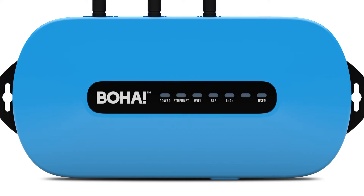It's important to know that the BoHa Gateway's signal is strongest when it's in an open space and not located inside an enclosure, such as a cabinet. The BoHa Gateway will flash three LEDs when successfully connected: a solid green for power, flashing green for Wi-Fi or flashing yellow for Ethernet, and solid orange for LoRa. LoRa is the wireless network that sends the data from the sensors to the gateway.